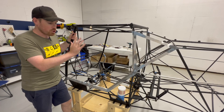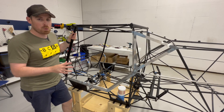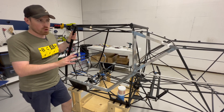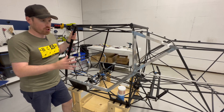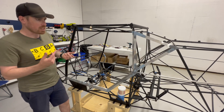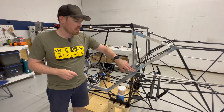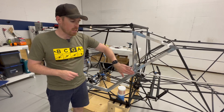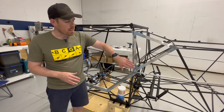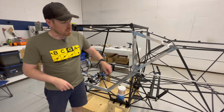And just like that, the doorframe and window frame bodywork is done. It took a couple of weeks to get to this point, but I'm happy with where it is now and I don't think I can improve it anymore with my current skill set, so I'm going to call it done and move on. I used Hysol with micro balloons mixed in to build up some of the joints where the overlaps were, and then used Superfill over that to get the final finish and smooth texture.